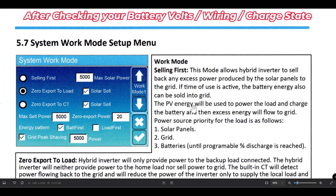I see this as a setup issue, not a unit problem — the unit was working as it's meant to. If it had a problem it was shutting down, resetting, and trying to restart, which it did do every single time. So I ticked 'battery first' instead of 'load first,' and it's been about four days. Not much solar coming in at all with this weather, and we haven't had that fault since I ticked 'battery first.'